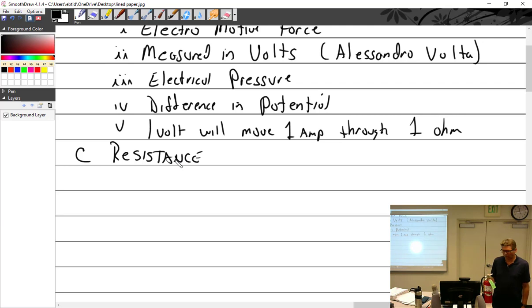That's right. So, if I were to, in theory, take this room, seal it off, and pressurize it to the point where the outside pressure equaled the inside pressure, then this gauge would say zero. Nothing would go wrong, right? Squeeze a button and nothing would happen. If I pressurize the room a little bit more and squeeze the button, air goes into the bottle.